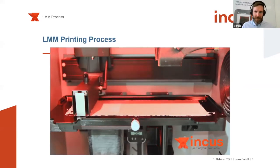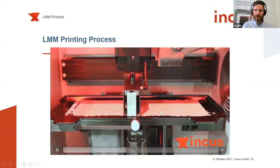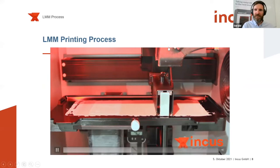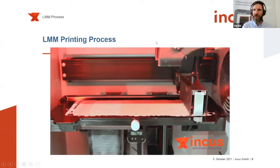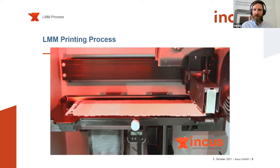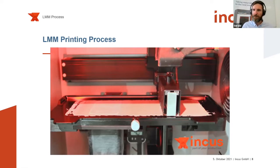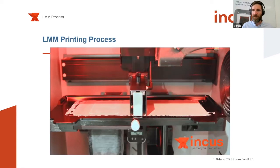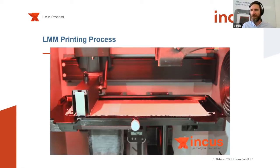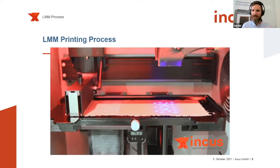So this is a real-time video of the printing process. It doesn't get more exciting than this. And what you see now here on the building field is the polymerization of the layer. On top of it, we have this industrial light projector unit with 35 micrometer resolution in X and Y. And after every coating step, we do this polymerization of a single layer. The polymerization happens all at once. It's not a laser-based system. Maybe some of you know when you do a laser polymerization or a laser melting process, you need to really write the single images or the single sections of the parts.